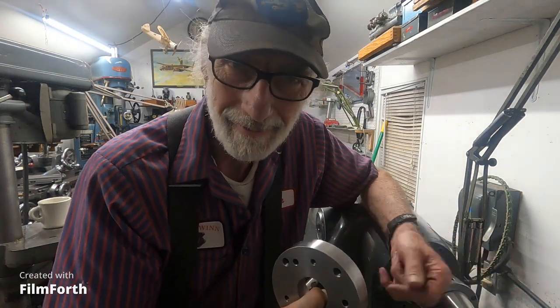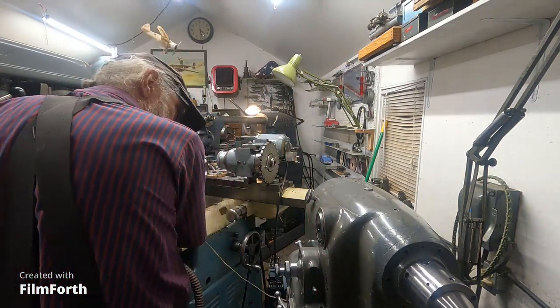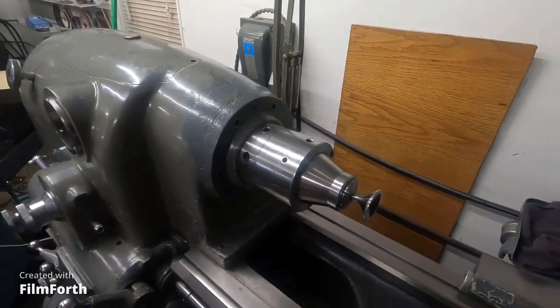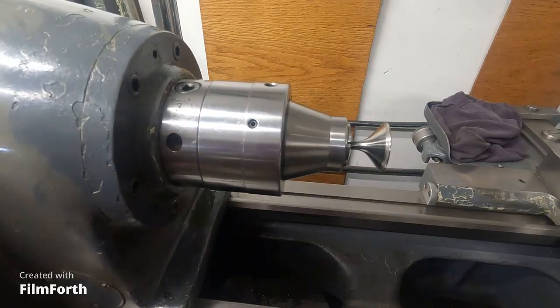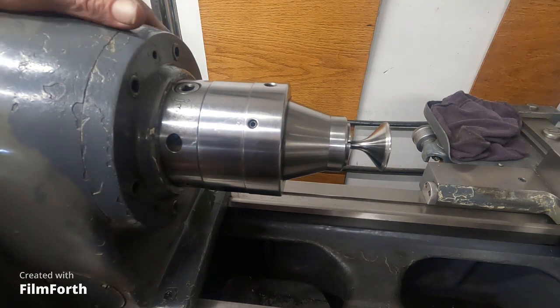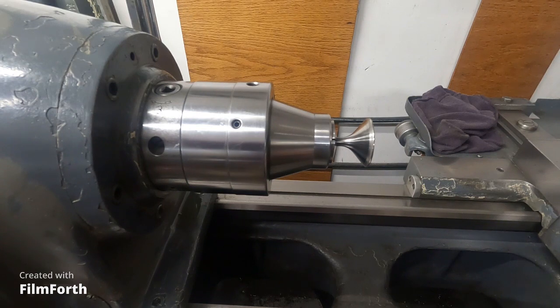Step one of what I'm going to show you is you need to be able to do that right off - make your own back plates. It's a toolmaker's lathe, why not? Now, this is the 5C collet chuck I fabricated for the Monarch 10EE lathe. I did not invent this - I copied this design from a CNC adjustable-for-radial-runout 5C collet chuck.